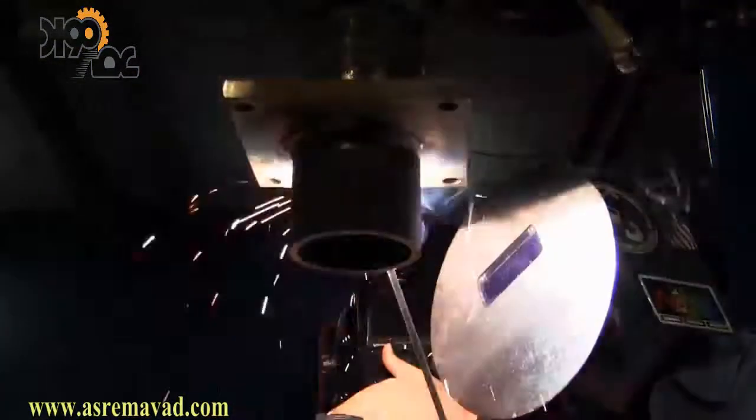Restarts are very important. You want to strike your arc in front of the crater so that you weld back over all your arc strikes. That applies with 7018 no matter what position you're in. Andrew is holding a nice tight arc here, keeping it jammed in there.